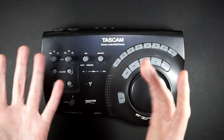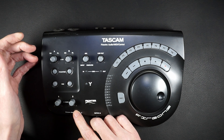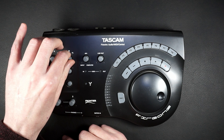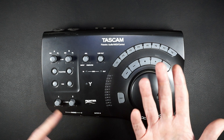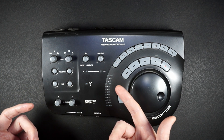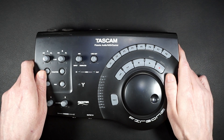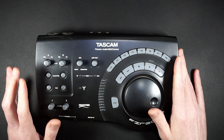You just want to stick with ALSA, which means out of the box PipeWire, Pulse, JACK — no problem there. Preamps are fine, a little underpowered at 53 dB of gain, but these are from 2007. If you've got a condenser mic you're in good shape — you've got phantom power. With a low output dynamic, as long as you're right up on top of the mic, because you really don't want to run these at absolute max as they do have a little bit of noise when completely flat out. Having two headphone outputs without custom mix capability isn't surprising at this price point, but they're still neat if two people want to listen at different volumes. The guitar in is a good one though — quarter inch high-Z, just plug right in. And it is bus powered so you won't need to carry around a power brick.